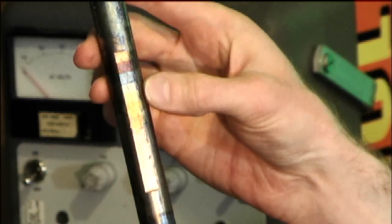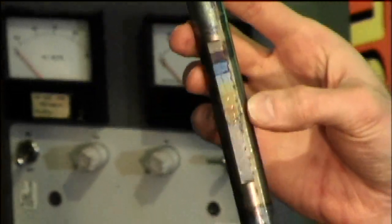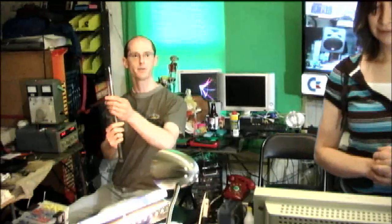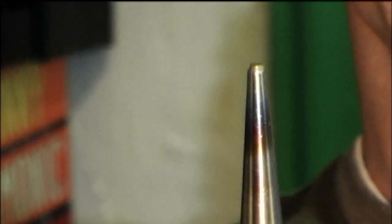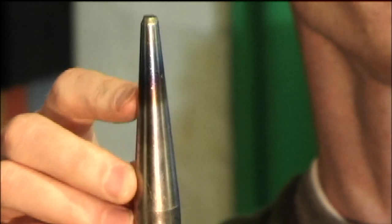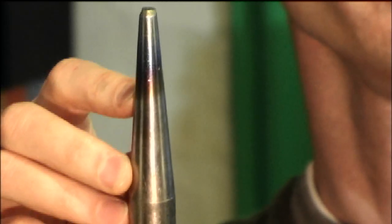So if you bring up more 9-volts in series, you can adjust the color. Does it eventually form an oxide where no more voltage can jump to the titanium rod? Yes, that's true. If you watch the current as you apply it for a long period of time, you see that current decrease, so you can actually time it too. This other example is where I just dipped the titanium into a little pool of Coca-Cola in a metal can and pulled it out — some sections were left in longer than others, so this is turning yellow, blue, and more of a brownish.